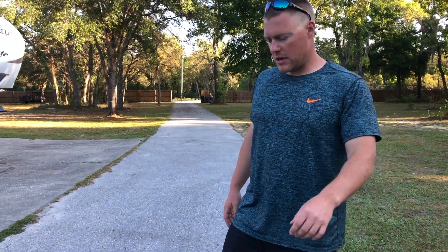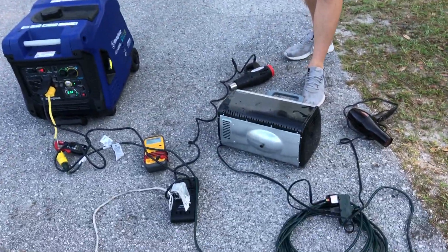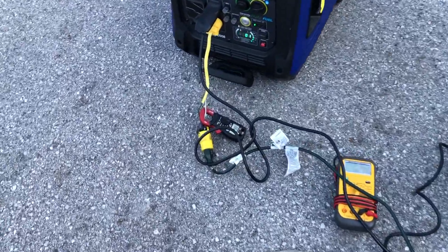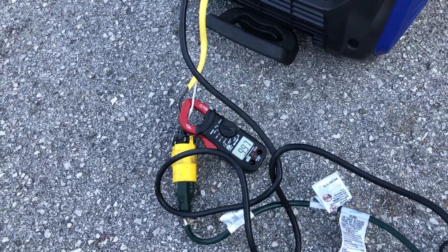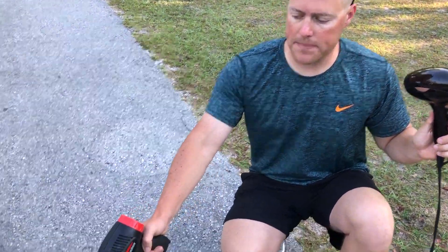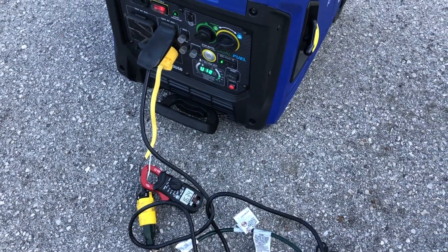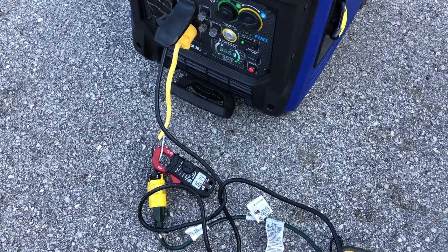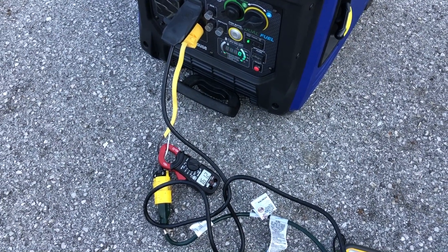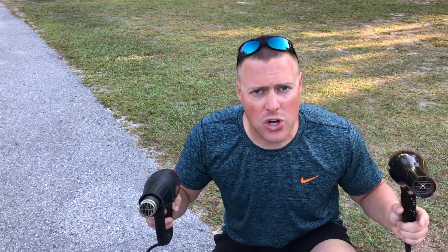So now we're running on gas. Right now we got the heat lamps on. We got the toaster on. We're pulling 10 amps on the lamps right now. Now we'll go ahead and finish with the hair dryer. So now we're up to 16 amps and we're getting ready to engage the last piece right here. We don't get that amperage drop — it stayed. We didn't get the amperage drop which we experienced on propane; it just stayed there.